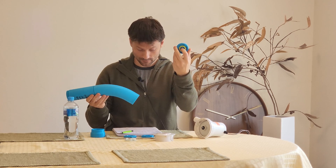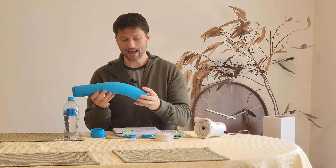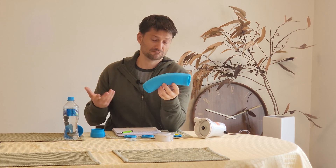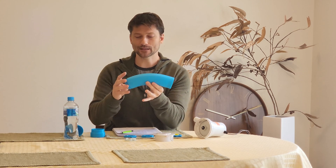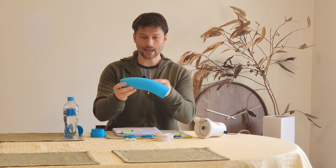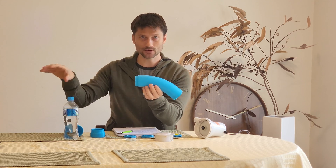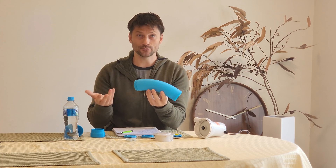So I'm already up almost 40% in power output. Now I have to figure out which Venturi design is the most efficient to get the most out of that. As I was doing this, I'm looking at this piece and thinking this could be a dredge nozzle. This is printed out of PLA, but if I were to print it out of carbon fiber impregnated nylon, or maybe PVC or ASA, this would be a fairly durable, real-world usable nozzle if I had the Venturi built in. It could be one pipe that you connect your bilge pump to, with a fitting to slip a 2-inch dredge hose onto. I could have a single jet, a double jet, maybe a ring jet built within here — the 3D printer really allows you to do a lot of stuff.